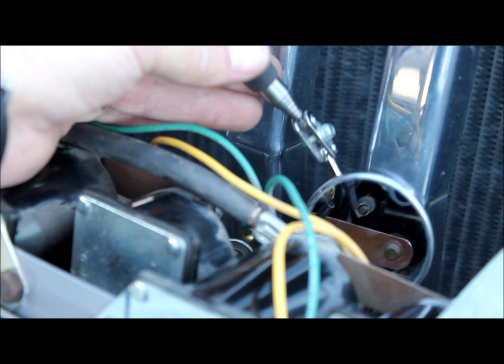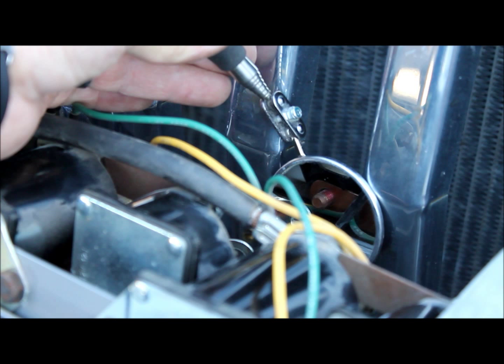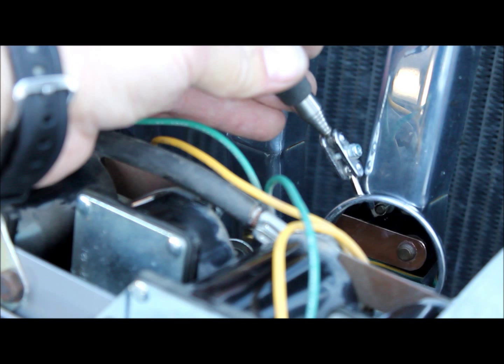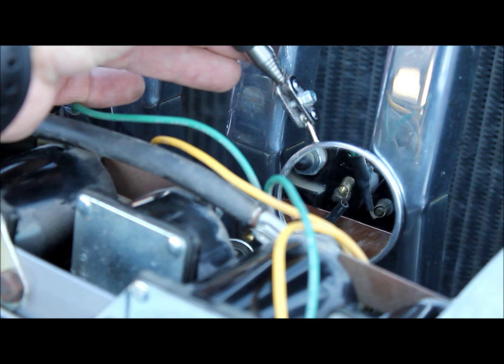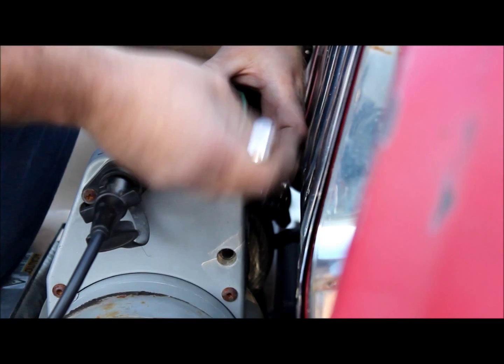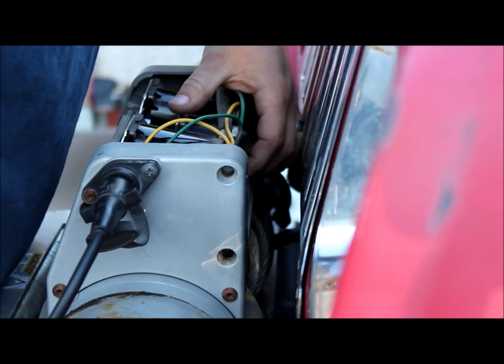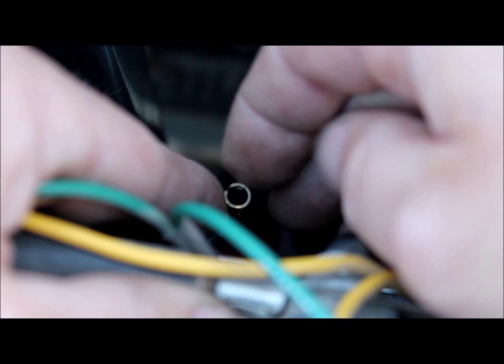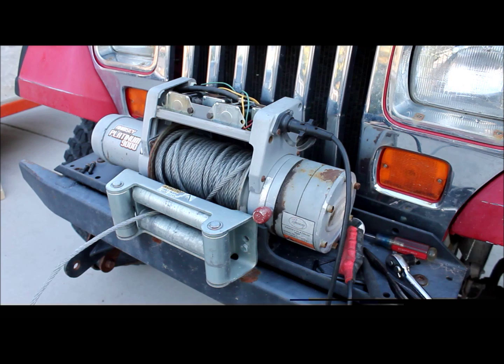I've test fit this on the back there and it was such a pain that I'm just going to leave it on there. I just have to put the lock washers and lock nuts back on and then reconnect the fitting to the solenoid — the angle is just so hard to get with the camera. I also wanted to show you there are several of these little connectors that bring power to the back of the solenoids. A couple of these were loose, so I just re-crimped them, pinching them closed with needle nose pliers so they fit tight on the terminals again.